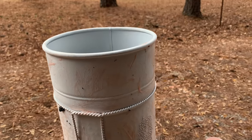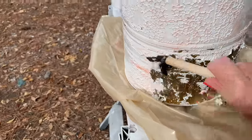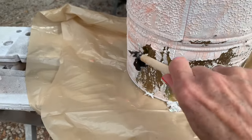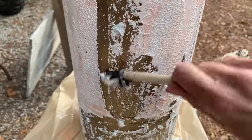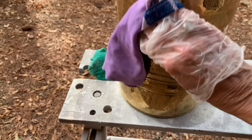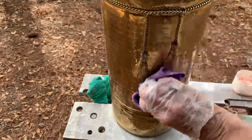You apply this in a pretty thick coating and let it sit on your item no longer than 30 minutes, because if it starts to dry you'll have trouble removing it. After a few minutes you can see how it's already making the paint bubble up. I'm just taking my sponge brush and kind of scraping it to see how easy the paint removes — and it is pretty much just coming off. You can take a toothbrush or a rag and go in and remove the paint. In some areas I had to apply a little more citrus strip and use a little toothbrush in those little tassels. I also took it over to the hose pipe and hosed off a lot of those paint flakes, and that really helped.